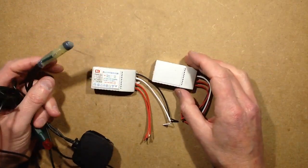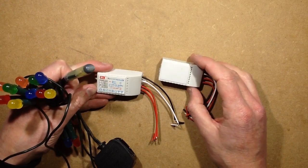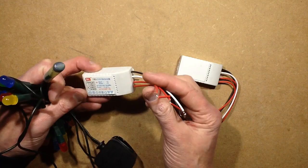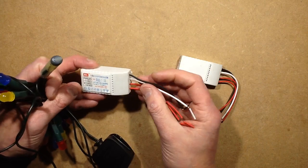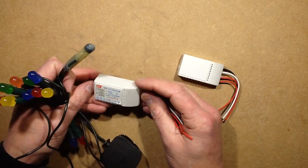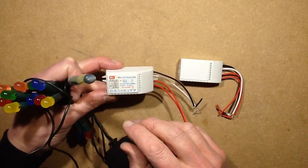And by sheer coincidence, on eBay from China you can get these little LED controllers, and they're actually capacitive droppers. I'm not sure what their actual application is. I guess it's maybe displays or something that just have the LEDs run at mains voltage. You can use these outright, because this is their intention, to run a string of these LEDs.